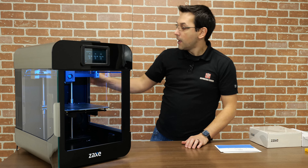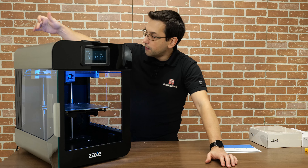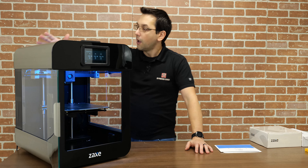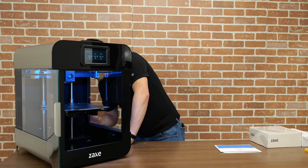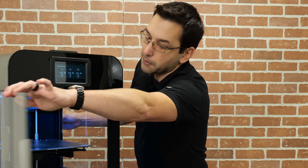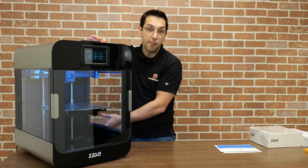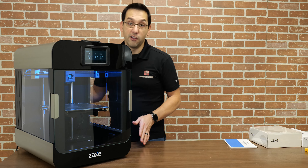Normally I like to make sure all the axes are moving as expected. Your first time homing something, you want to be there ready to turn it off in case something goes wrong, or in case you forgot to pull one of these clips out and hear a grinding noise. I've moved the Z — let's go back and move the X. It says it's at minus six, which makes sense since we haven't homed anything. So this is tens, that is ones, and that's 0.1. Labels will probably be coming in a future firmware update.